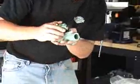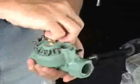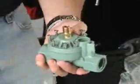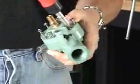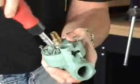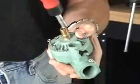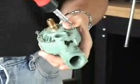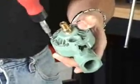Put the spring back in — it fits right over this little guide piece and goes on here. Make sure there's nothing in there, then sandwich it down. Put your screws back in. I start at one end and tighten it down, kind of like a gasket on your car — go to the opposite end next so we get a nice flat even tightening. Skip over and just kind of alternate around. The reason I do that is I want it to seat evenly so we don't pinch the gasket or get any gaps in there.